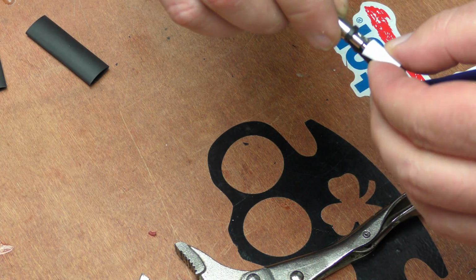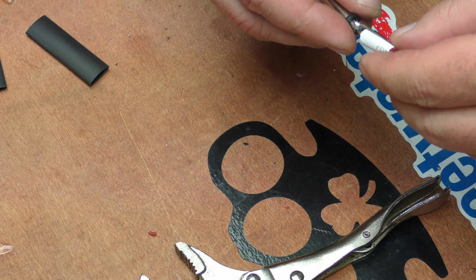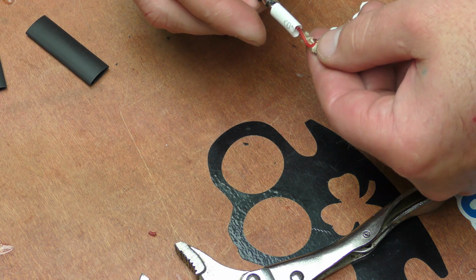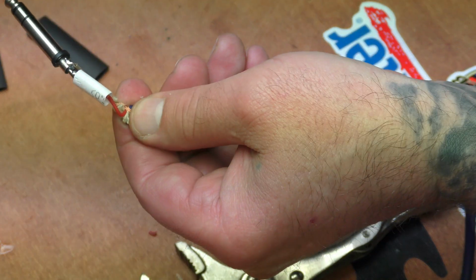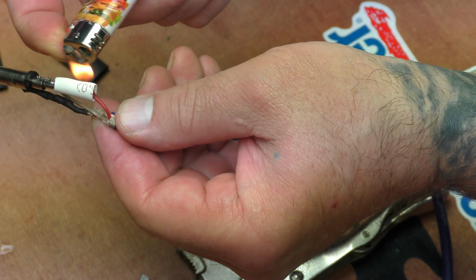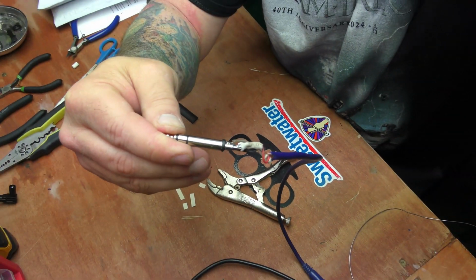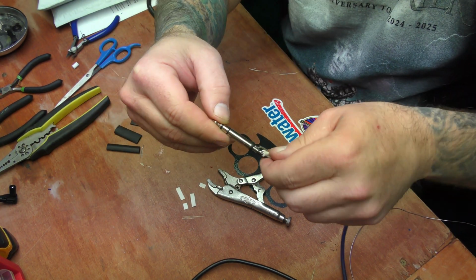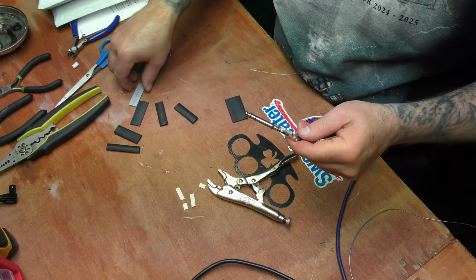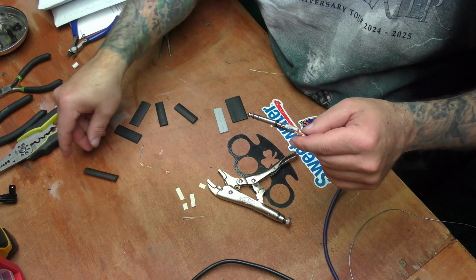And what we do is we'll just run this heat shrink right over that package like that, making sure all of our wire is connected. Now let's use a lighter to shrink that up. It's all together like so. Let me zoom you out. We're going to bend this all and then we're going to build this jack back up with consecutive wire heat shrink.